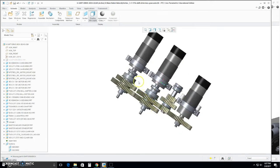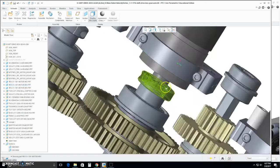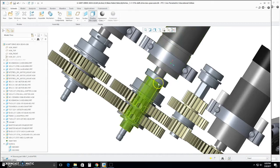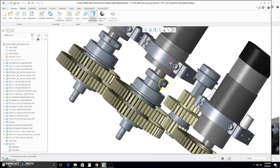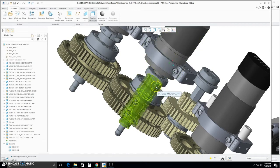So to see inside the gearbox here, we're connecting either a REV motor or a Neverest 40 directly into our VEX ball shifter using this custom adapter piece we made. And what we did with this piece is we didn't want any slipping to be possible with set screws, but we didn't have room for a regular hub or D-clamp, so we chose to make our own clamp that would convert from the 5mm hex or the 6mm D-shaft directly into a 1/2-inch hex for our ball shifter. We did this by machining a square-shaped hole with a very small cutter so that we would have clamping force on 2 sides of the shaft.